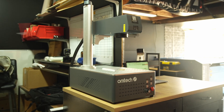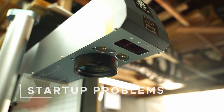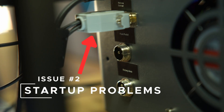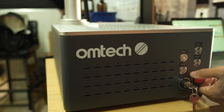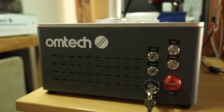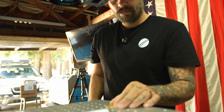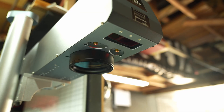If the autofocus is making your laser not fire, it might not be an autofocus issue — it could be one of these common startup problems. First, make sure the remote control plug is fully inserted. Next, turn off your e-stop button and press the reset button. Then turn on your laser key switch. Also make sure your galvo head is positioned at the correct focal height, because if it's too far off, the laser won't want to fire.